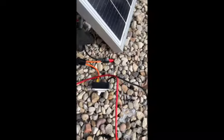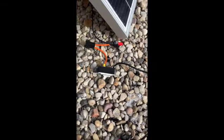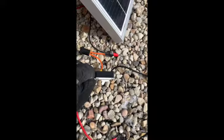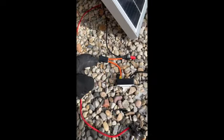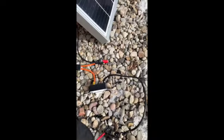It's just when you go connect it up at the other side, I have to make sure my fuse is on the positive line. So I used a red one, and again, one more reminder to me, I didn't have any more of the pins that go inside of the MC4 connector. So, just making sure I connected the right wires to the right point, because you don't want the current to flow the wrong way and your fuse doesn't work properly on your negative, because the power is now going back to the panel and you want to catch it before it gets to your device.